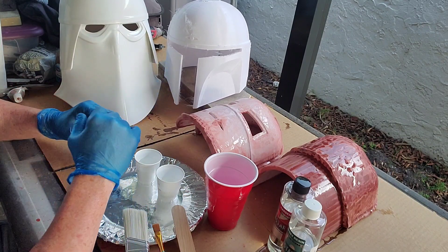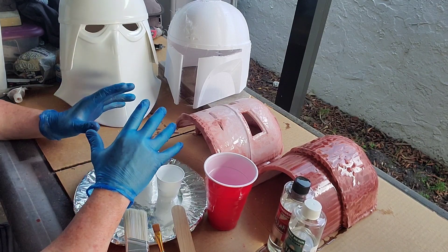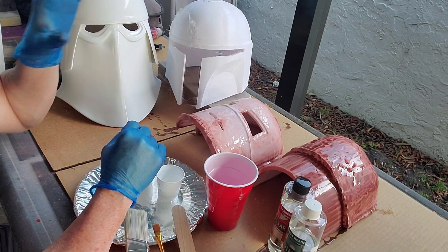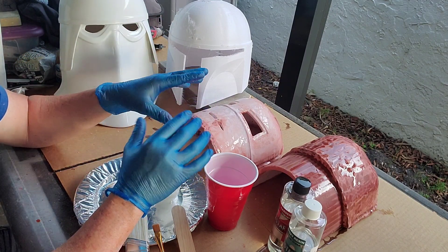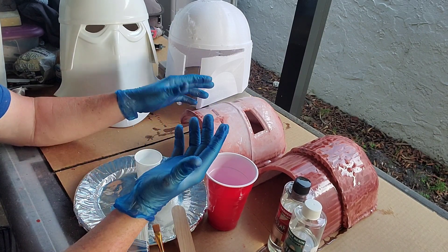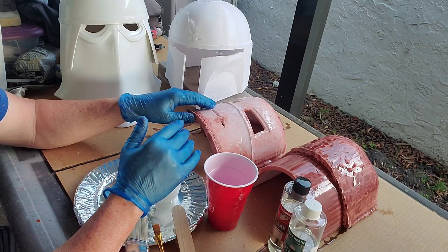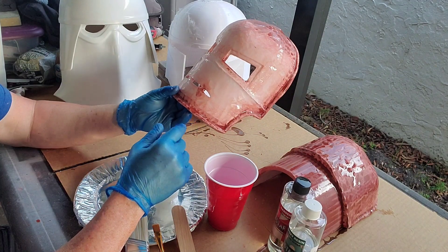What I found is that I sand and go through the process of sanding, then fill the bigger imperfections — any big divots, holes, or craters in the print. Then I go ahead and hit it with a resin, and once that hardens you have a nice smooth surface that can be sanded down. It basically turns it into a hard plastic, which is what you want. It gets rid of most of the layer lines — about 90% of the work will be done once you throw this layer on top.